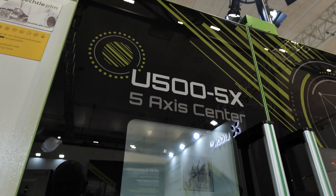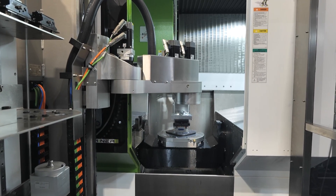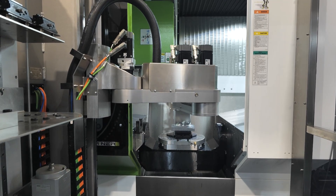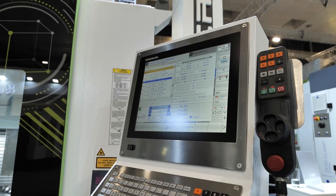Let's break down that price-performance ratio. The C500 is a five-axis machine — you can see the trunnion table and the HSK 63 spindle. It's a 15k spindle with a 60-position ATC, full five-axis simultaneous control with either Siemens — which we have here — or Heidenhain TNC 7. All axes feature glass scales and encoders from Heidenhain. It's a full package.